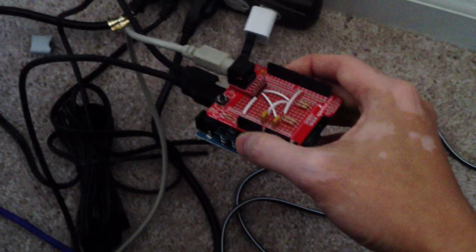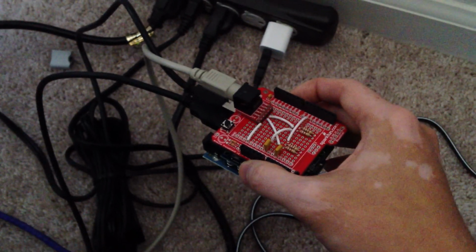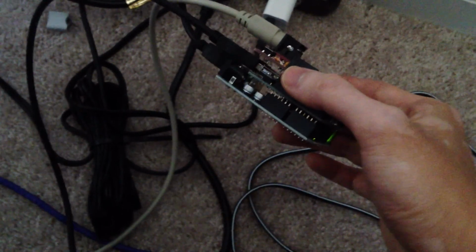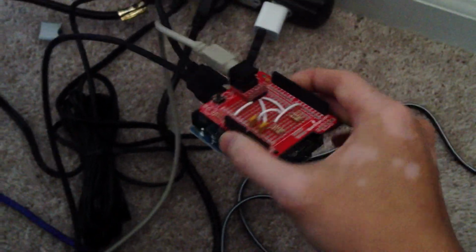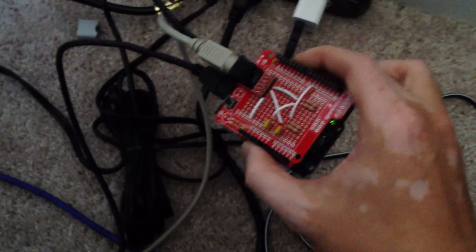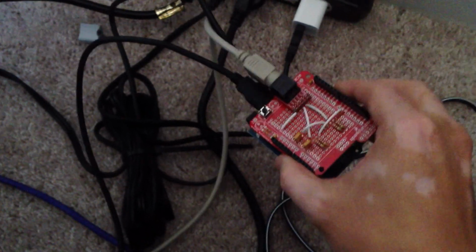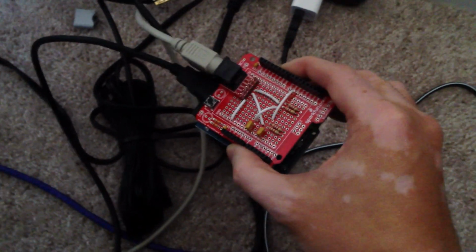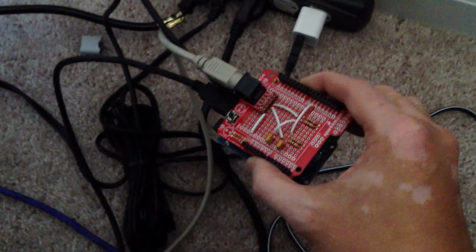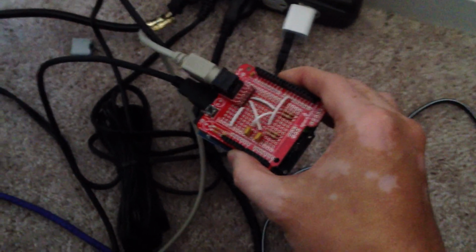And of course, the goal in order to make something compatible with the Fanatec wheel is to basically generate certain voltages on the X and Y axis for the Fanatec to understand it. It's not easy to do that with an Arduino because it's digital, but with this technique called pulse width modulation and what's called a low-pass filter, if you guys aren't EE, you'll have to look this up. But essentially, it's a way of translating digital outputs into an analog voltage. And the resistors and capacitors let you do that.